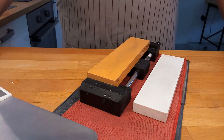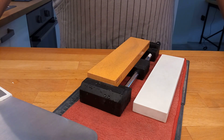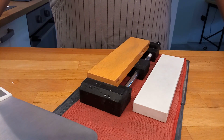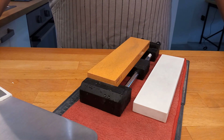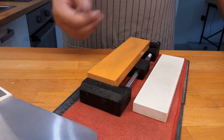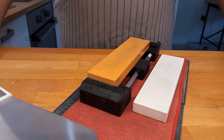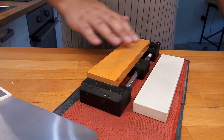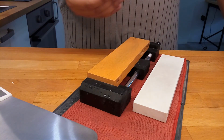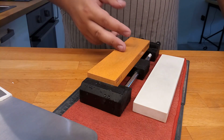Of course, with this stone, alterations will be done just to get familiar with how it works. So I will finish it on, let's say, 600 silicon carbide abrasive grain, going down to 400, trying 320, searching for the best conditioning, the best finish of the stone. At the moment it is smooth as glass, and when I refine the scratch pattern,